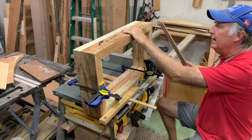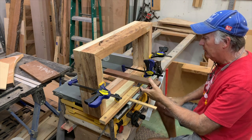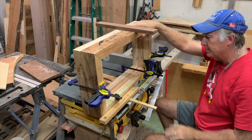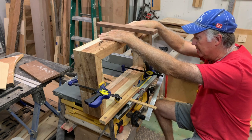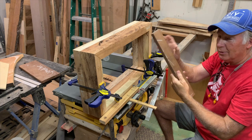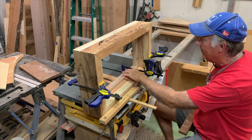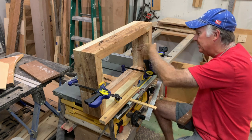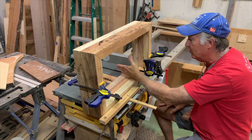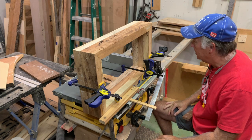I'm preparing to cut the slot — the half-lap — for my brace that's going to go on the back and on the front. I have the area taped where this is going to go: half-lap in on this side, and half-lap in on the other. I have the three legs ganged together and set up so the depth of the cut is shallower than the piece — it may protrude a little, but I can plane that. This is walnut, this is pecan up here. With the three pieces pushed up against the fence, the cut will be at the right spot for all three. Then I'll flip it over and cut the other side.